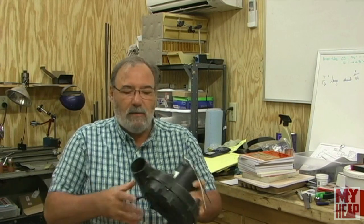I've recently acquired a 110-volt evacuation motor. So when you have a gas furnace for your house, before the burners kick on, it runs a blower to blow out any potential gas that's left there before it injects the gas and lights. So that's what this is. I had one that was 220, but this one's 110 — I think it'd be a little better. I plan on using this as the inlet on my furnace.